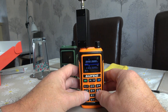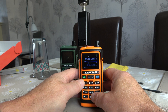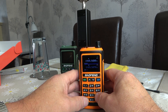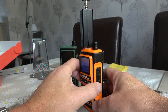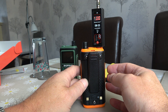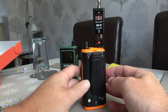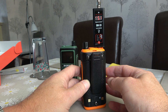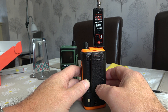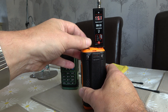Just to prove that this isn't a defect of the radio, we'll now put in the 2 meter band and do a power test. 145.500 — the 2 meter calling channel for the UK — and we'll now do a power test on the UV-17 Pro GPS running old firmware version 1.27. And there you see it is now outputting 5.1 watts on the 2 meter band. So the radio is not defective — it's outputting a healthy 5.1 watts on 2 meters but absolutely nothing on the 1.25 meter band.